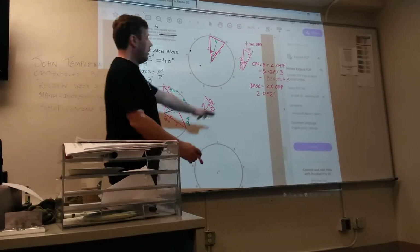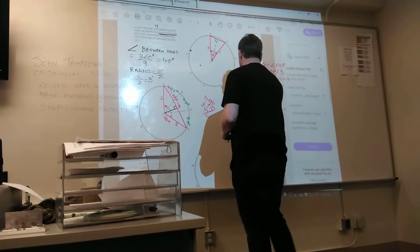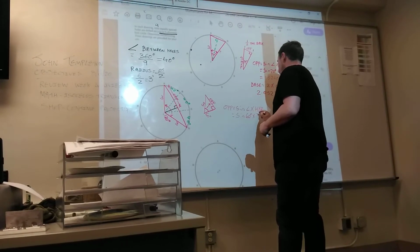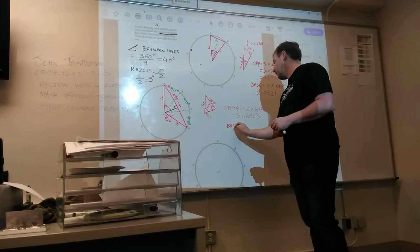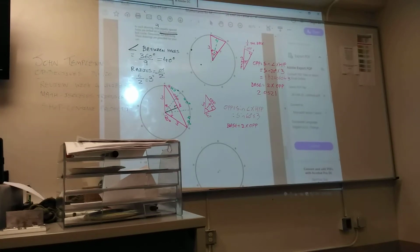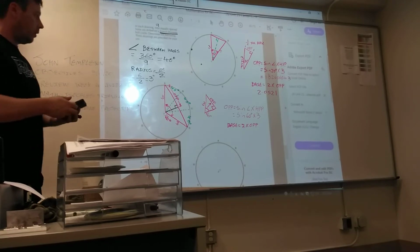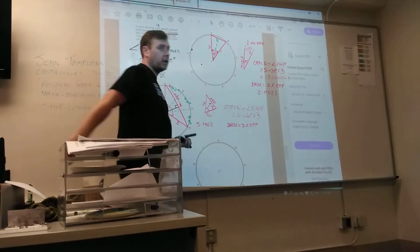So you're going to follow through those steps again. Opposite. Sine of the angle times hypotenuse. Sine 60 times 3 is 2.5981. And the base is equal to 2 times your opposite. So we times that answer by 2? Yeah. 5.1962. That's it.